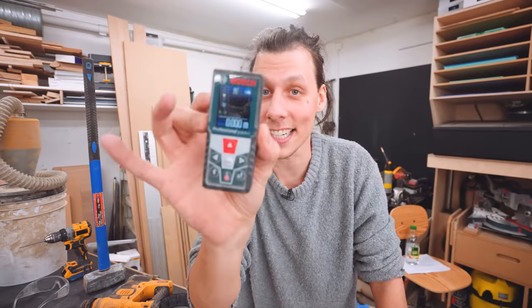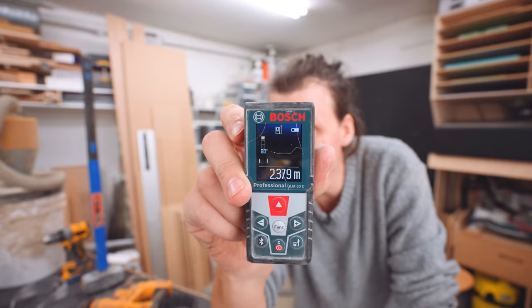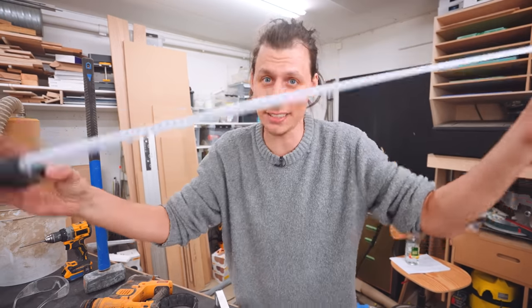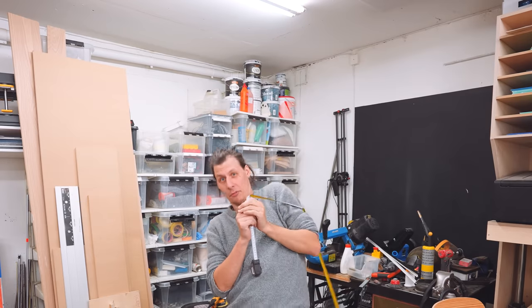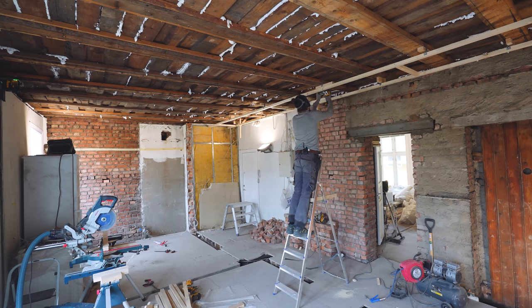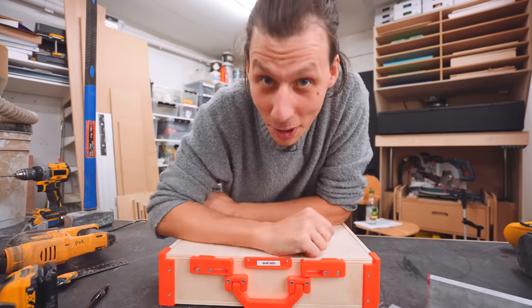This little tool is fantastic - a laser measuring tool. It uses a laser you point at something and tells you precisely how far away that distance is. It's especially convenient for measurements that aren't on a flat surface, like floor to ceiling or to a wall that's far away, where a tape measure gets really cumbersome. I use it all the time in the planning phase to get exact measurements of a room, and during construction - like when I built my new ceiling and had to measure stud lengths all the way up where none of the walls are 90 degrees to each other.